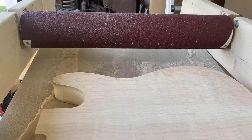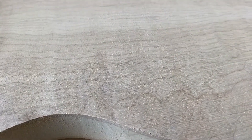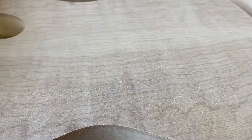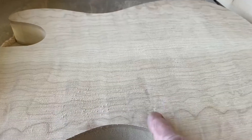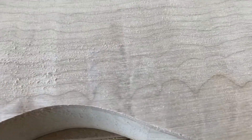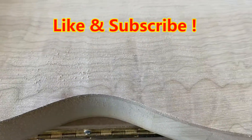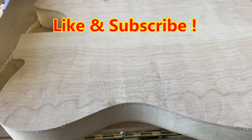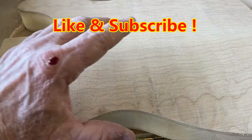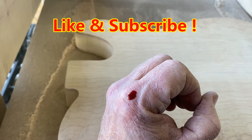Do not adjust the height of the table too fast, because if it gets too tight you'll have trouble shoving it through. Here's a low spot right here, but I still have plenty of thickness before I need to stop. My sandpaper may be a little on the coarse side. Use a push stick or have gloves on, or your knuckle will hit the sandpaper — and that's what you're going to get.